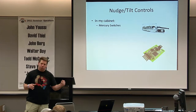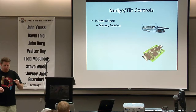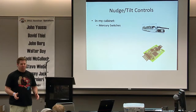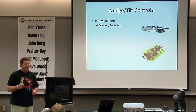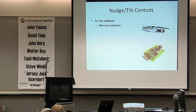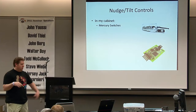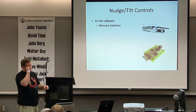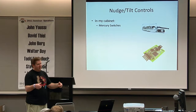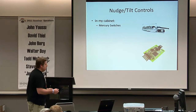So I went to mercury switches. All they're doing is mapping to the different keyboard keys — Z, space, and slash for the nudge directions. I can screw the switch onto a piece of wood inside the cabinet and bend them to make them more or less sensitive. For tilt there's also the U-HID from Ultimarc — a very expensive little board at $60, though I haven't really used it much. People have also taken a real tilt bob and modified it to use as a switch.